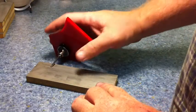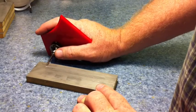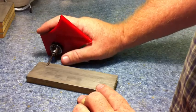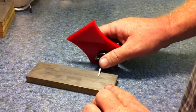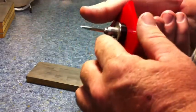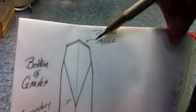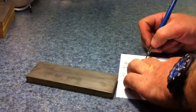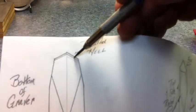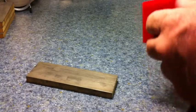The last thing is the heels. I don't put much pressure with my thumb — I just grab the template to keep it running flat, and let the weight of it apply just a little pressure to hold it onto the table, not necessarily the stone. I drag it lightly across twice on a 2000 grit stone, and that gives me the width of heel I prefer. Some prefer longer heels; I like them short — meaning this part isn't very wide. But you can do it any way you want, and that's all there is to sharpening the graver.